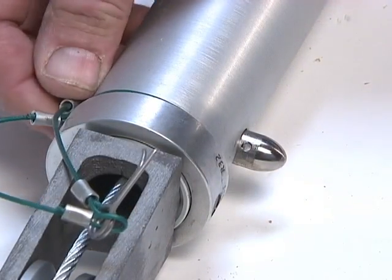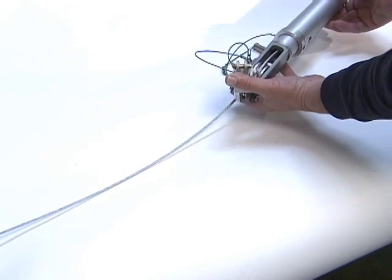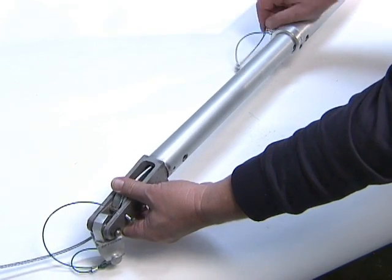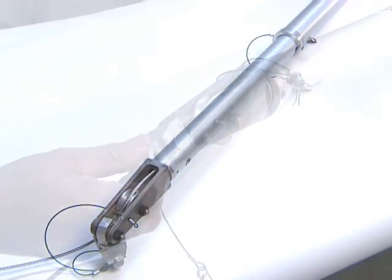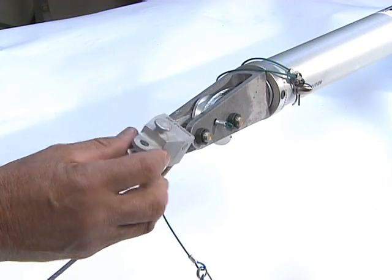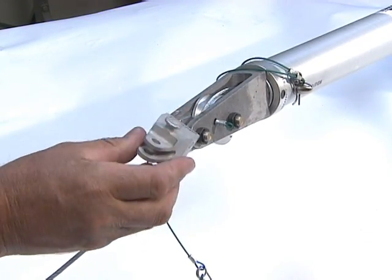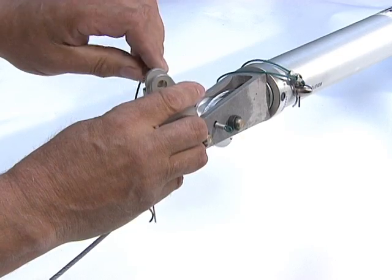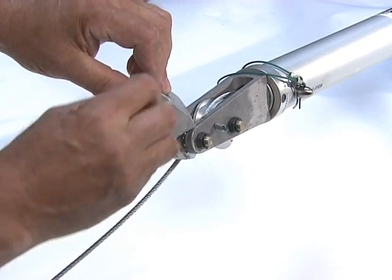The hoist also includes a telescoping barrel for long reach. The barrel length is easily adjustable simply by removal and reinsertion of the barrel lock pin. Another great feature of this hoist is the swivel attach block. The block swivels from the end of the unit and includes both a key lock interface and an attach pin system. Either attachment secures the hoist to the airframe.